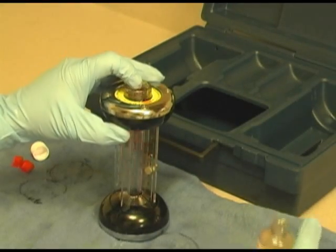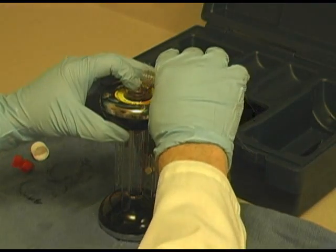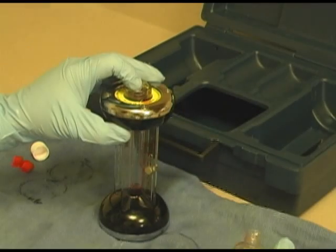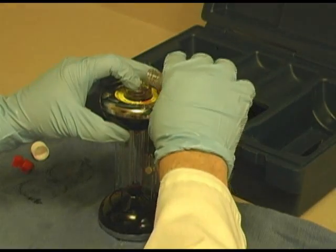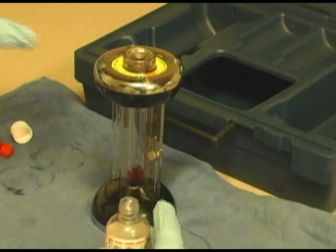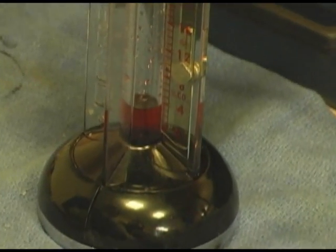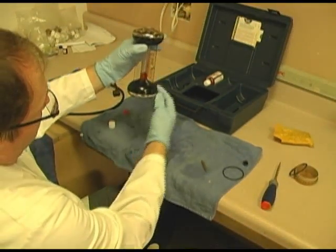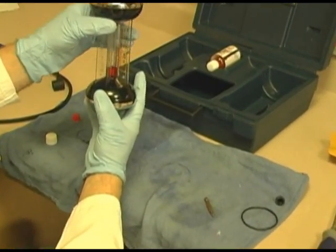And by the way, if you run out of Fyrite, or if you start getting low, you just put a couple drops of distilled water in it. Won't hurt it at all. And that looks about right for me. A tad more. I have a tendency to overdo, not underdo. Alright, now of course you can see that I've got enough range so when I zero it I can go up and put my zero where zero needs to be.